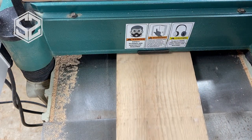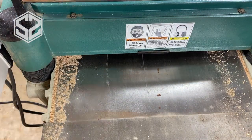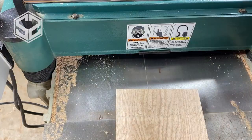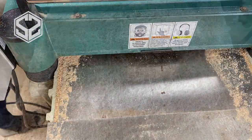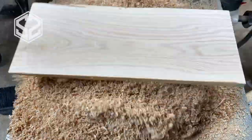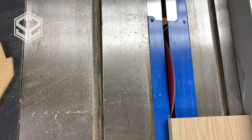I'm going to send this through the planer — it definitely doesn't need to be an inch thick, and right now this wood is rough cut, so I'm going to mill it down to about half an inch thick. Then it's over to the table saw to trim it to size and square up both sides of the board.